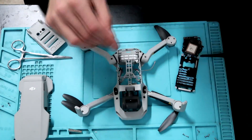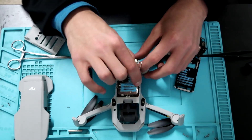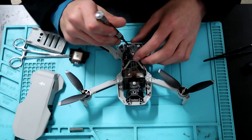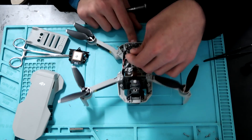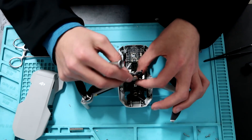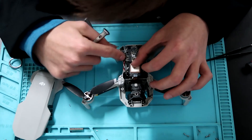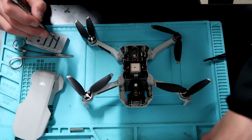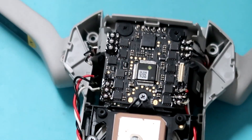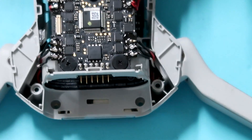So that's pretty much it for the Mavic Mini — fairly straightforward, not too many electronics in it. It flies very well; I've been flying it quite a bit recently. I do like the drone — the camera quality is good, and for a $500 drone you really can't go wrong, especially because you don't have to register it with the FAA. Putting it back together was very straightforward — the only tricky part was resticking those ribbon cables for the gimbal, making sure they're in the right place so none are getting kinked. On a scale from one to ten for ease of repair, I'd give it an eight or a nine. Here I'm just resoldering the motor wires to the ESC — the pads are very small but if you take your time you'll have no problem.